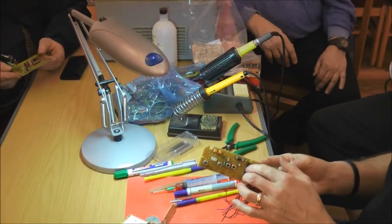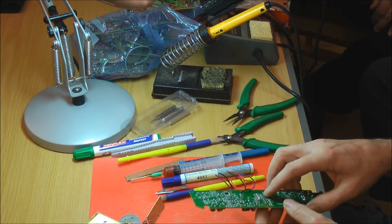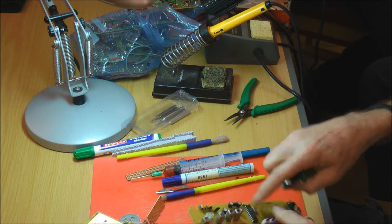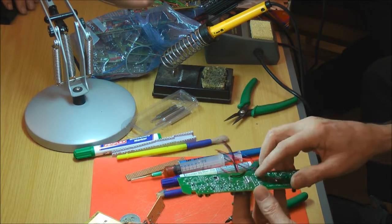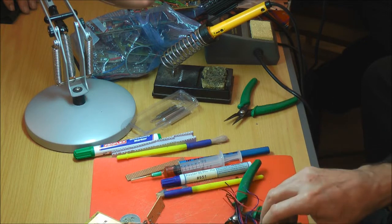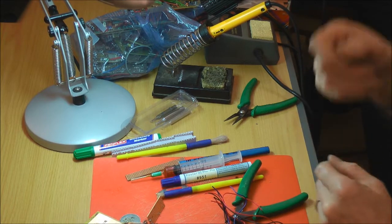You can go along and try to either use solder wick or whatever to desolder, and it depends ultimately on whether you know the chip is defective and you're going to refit it, or whether the chip can be scrapped. It also depends on how frail the design of the board is. If you have any doubts and you can replace the chip, your safest bet is to cut the legs and then simply remove them one at a time. That's by far the safest way, because what can happen if you haven't got them all desoldered and you start prying it out with a screwdriver is, if it's a through hole board, I don't know if any of you have come across the ones where it's literally like a spiral of copper in the actual hole of the board that joins the top and bottom, and sometimes you pull it out and that comes out as well.